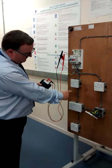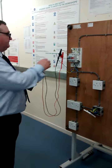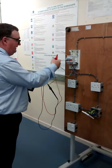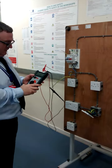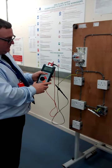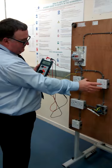So what that tells me is the cables going this way, coming here, including this conductor, are non-defective. However, I've now gone to the opposite leg of the ring final circuit, and hopefully find the fault, eliminating half of the circuit. So I'm going to test here. As you see, I've got a reading of zero megaohms. So what that tells me is from the CCU, going round the circuit anti-clockwise, there's a fault.